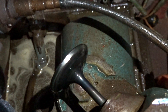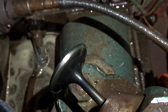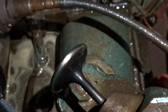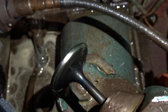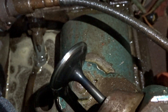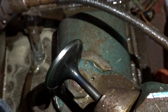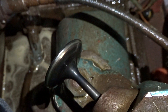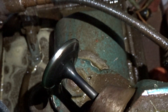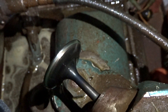You can see where the machine's been grinding and you can see that it's pretty uneven — it's grinding pretty much the whole face and then we go down to about half the face. So I'm going to keep grinding this one because that's no good, that's not concentric.